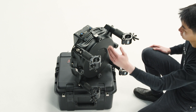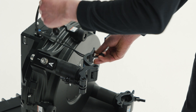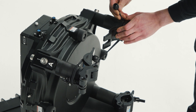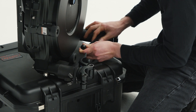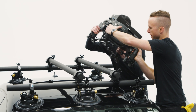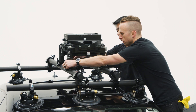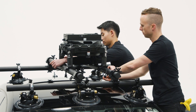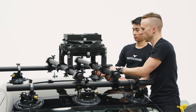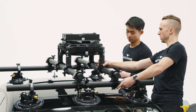Correctly installed base legs will have the clamps aligned with the main cable exit. Open the base leg clamps and secure them in the open position by routing the supplied bungee cords around the clamps, legs, and M12 shanks, then repeat on the other pair of base legs. With a partner, hoist the radical base over the SSG kit and place it onto the rails. Carefully remove the bungee cords from the clamps and then close the base leg clamps around the rails. With the base leg clamps still loose, slide the base fore or aft to the desired position and then apply adequate torque to the clamps.